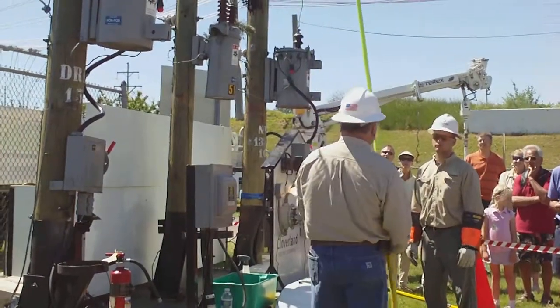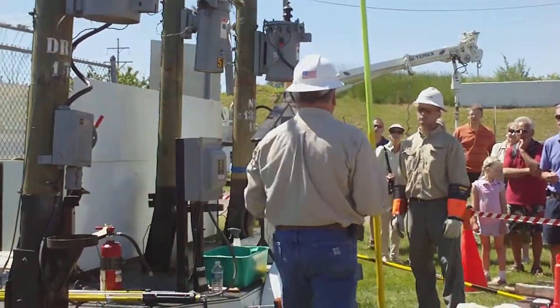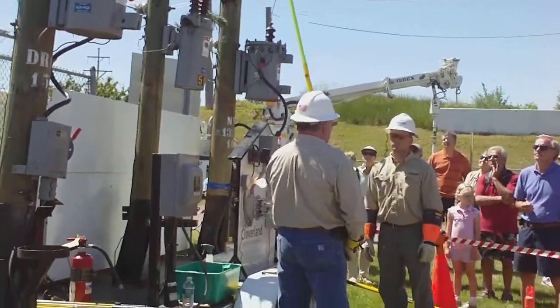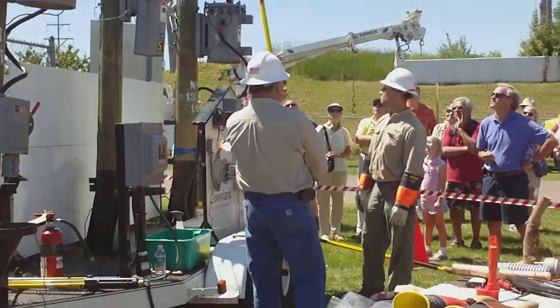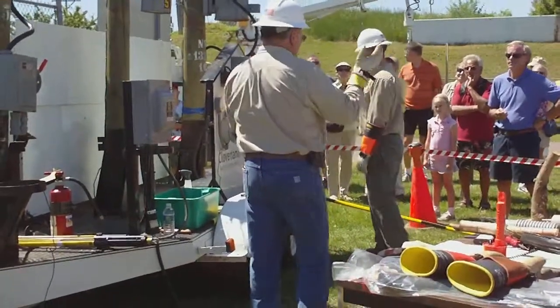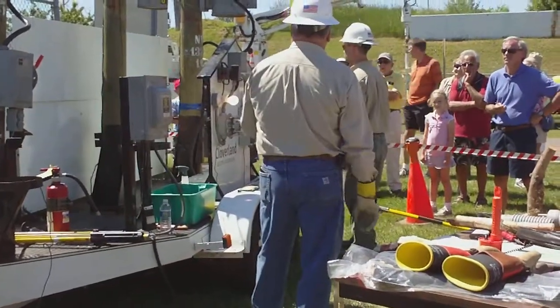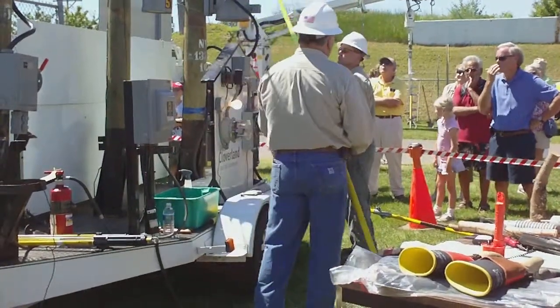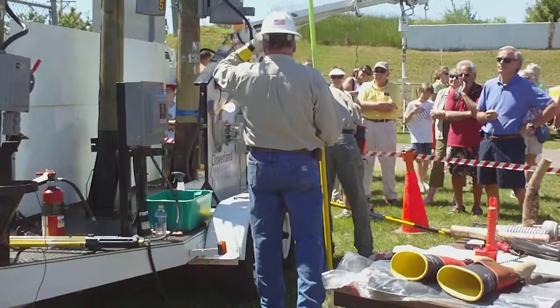It stays out. What happens is probably, maybe a car hit a pole, took it down, maybe a wire fell down, maybe a tree hit and knocked this thing down. Maybe the tree's laying on the wire and it's going to ground through that tree, or might be laying up or push that primary up against that neutral. The same as pushing it to ground.